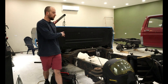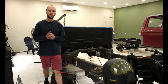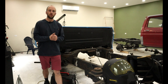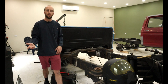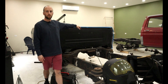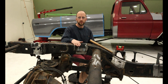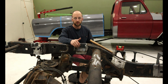We got the bed over here and I crawled underneath, checked all the body mounts, and we did find one that needs to be adjusted. That's exactly why you test fit stuff prior to actually welding it fully in. So we'll pull the bed back off — which we had to do anyways — set it over on the old truck, adjust the one body mount, and final weld everything up. This body mount here was the culprit and we just have to grind off the tack welds and readjust it.